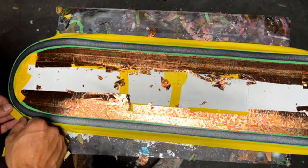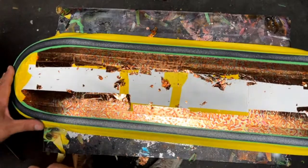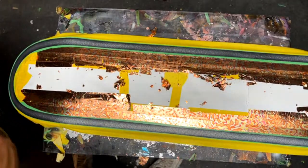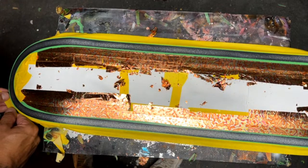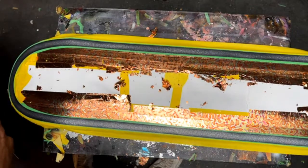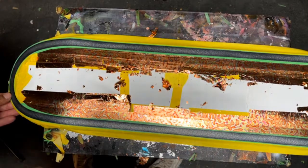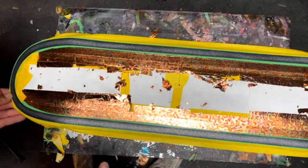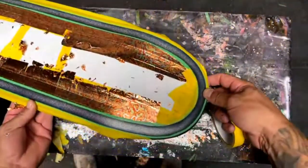A bad leaf job compared to a good leaf job. Yeah, because I always preach, don't oversaturate the leaf glue. Maybe not a live, but a video on what it looks like when you don't do it right. And then the other one was showing how to spray clear coat with the gun. Yeah, like smaller parts, because you're not full trigger on, full trigger off, like a lot of people have learned.